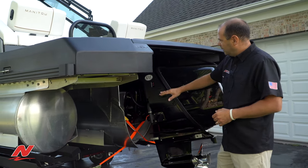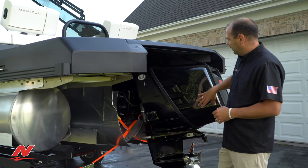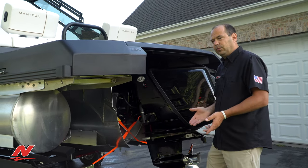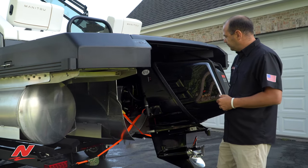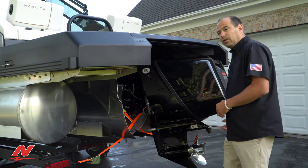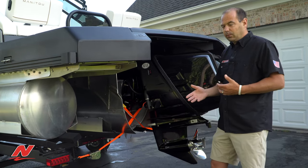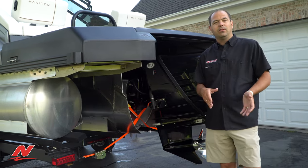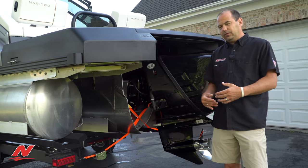How this works is, a lot of this is underwater. This is sealed. There actually is an air pump inside to keep air pressure inside, so if exhaust or anything were to try to backfeed in, it can't. They've really thought about water intrusion. There are sensors on the bottom where if water were to get inside for whatever reason, it will sense it and limit the motor accordingly. There is also a water pickup on the bottom — if there is condensation inside, it will actually pick it up and pump that water out.